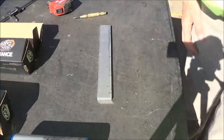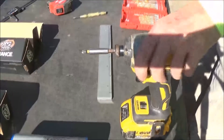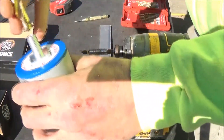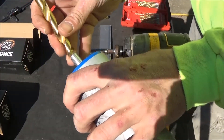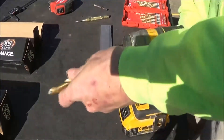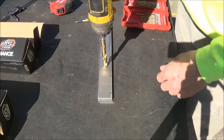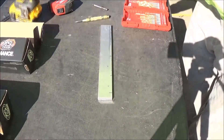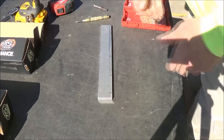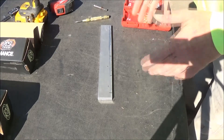Now my bar is punched. I'll come over here and get my drill bits, pick out the appropriate size for the terminal. This is a half inch. You would drill your hole — find your punch mark, set your drill bit in the punch mark, and then drill. Make sure that you get your holes straight up and down. You don't want your hole cock-eyed. I recommend a drill press — that's what's going to work best.